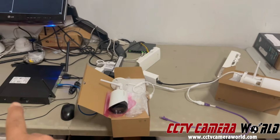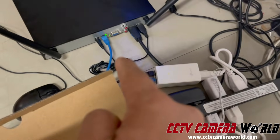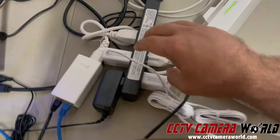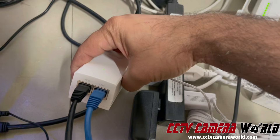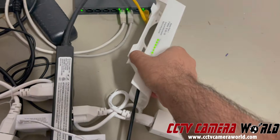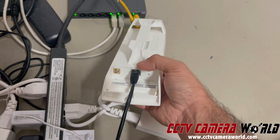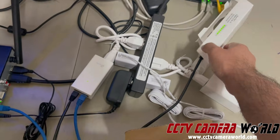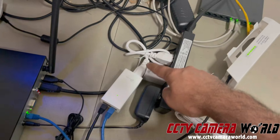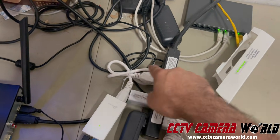What we have here is the NVR on the left-hand side, with a LAN cable coming out of the LAN port into the LAN connection on the PoE injector, and a PoE cable from the PoE injector going into AP1. The access point labeled AP1 plugs in here. The black cable goes into the PoE port of the power injector, which also plugs into 110V.